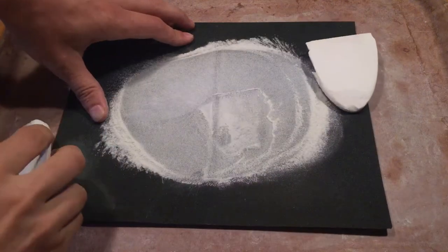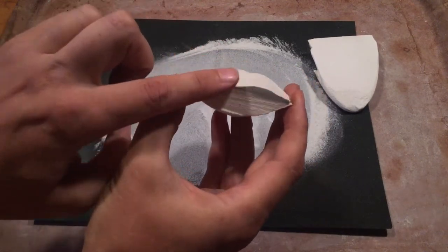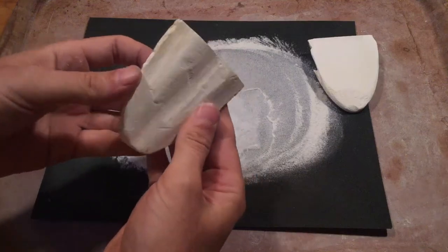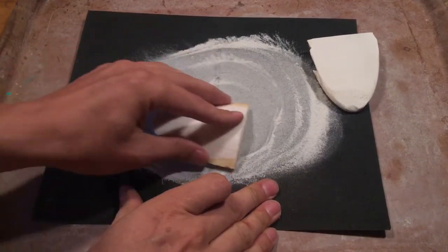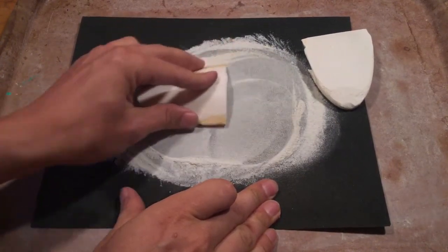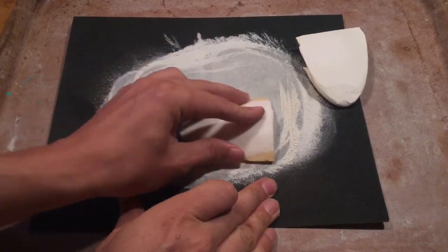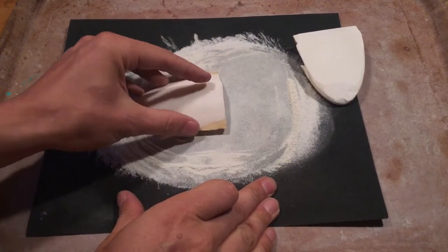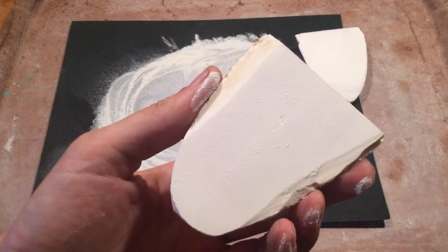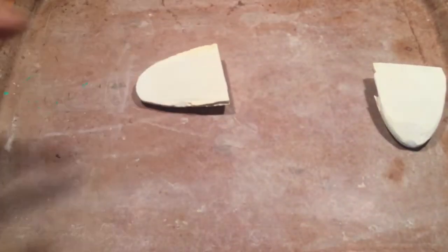That's pretty good. Now we've got to do the same thing on the other end. One thing to notice is we have a deeper groove contour here as well as a secondary groove contour here, so it's going to be a little trickier to get this one completely flat. It's fairly close, and if you look in the center we have some sort of divot indicating that there's a piece of debris on our sandpaper, so you want to clean that off.